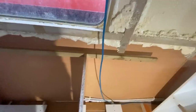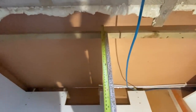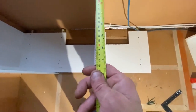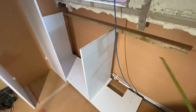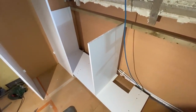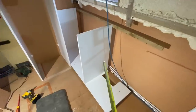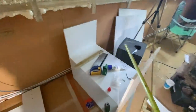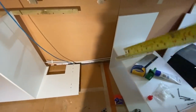It looks like I'm going to have enough room. From right to the edge of the wall to the edge of the unit when it's pushed in place is 530mm. I've got a 600mm counter — if I take off 70mm and have it at 530mm, I'm going to have to work that out. Am I going to go for a mitre across there at 45 degrees, or do I go all along and butt-end it with a longer piece here? This is the piece where the gas hobs are going to be.